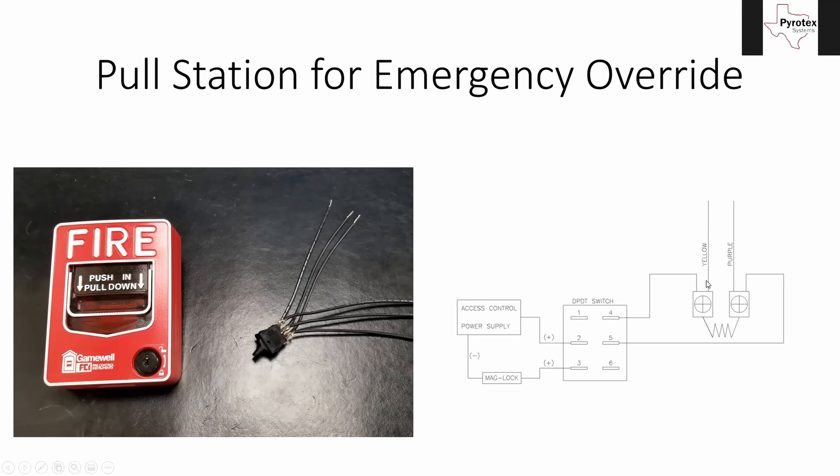When this switch flips positions, this side closes and this side opens. The current takes the path of least resistance from terminal four to terminal five, returning to purple and skipping the resistor — causing a short circuit that tells your monitor module there's an alarm. And the contact that used to be closed is now open, so the power that was keeping the lock energized is cut, turning off the lock. By pulling that pull station, the person has activated the fire alarm and unlocked that door so they can get out — they won't be trapped in the elevator lobby and can reach the stairwell.